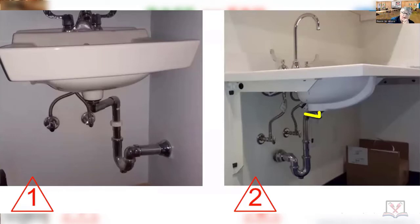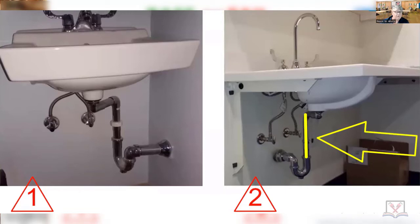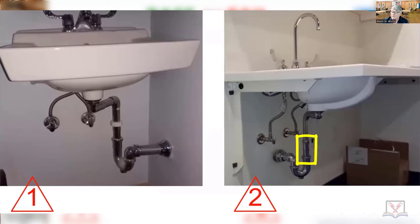You wouldn't be using this particular assembly either. If none of you have ever seen this before, this is actually a proper assembly for handicapped lavatories. A wheelchair is going to come in and be set back or off to the side so someone doesn't hit it with their legs. All of that should be insulated. You're seeing two pieces of straight waste — the one on the right is a straight waste with a proper jam nut, and that one is brass, chrome-plated brass.